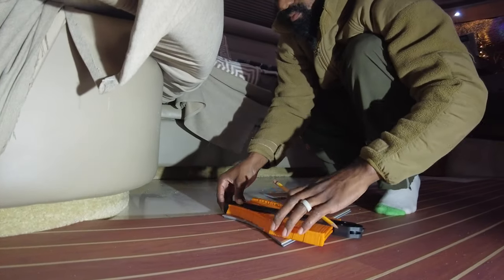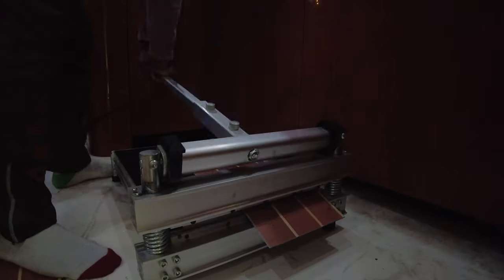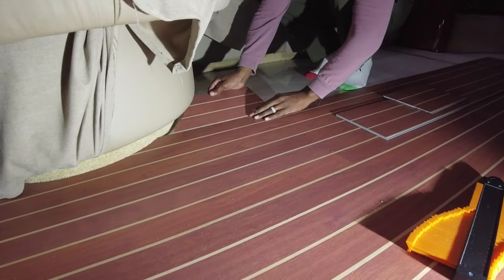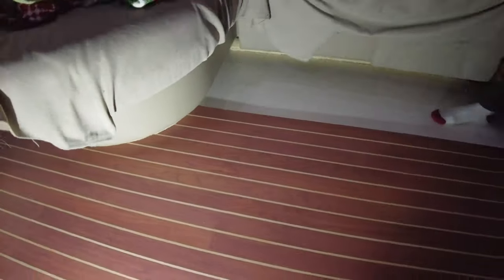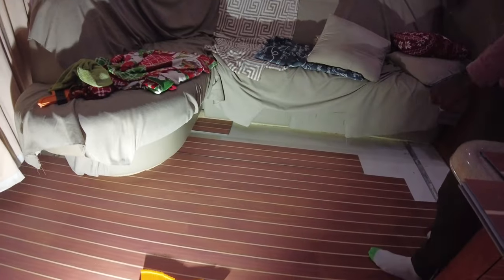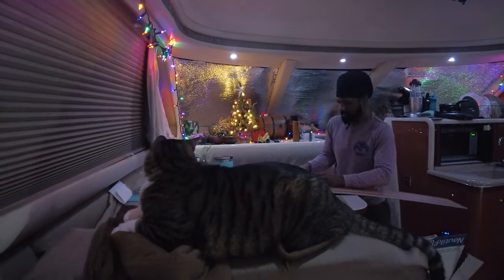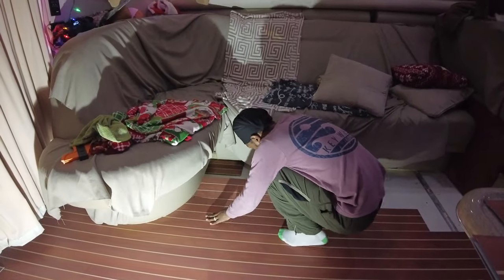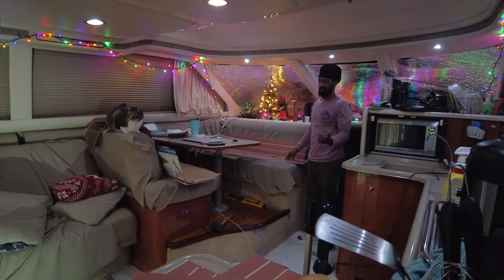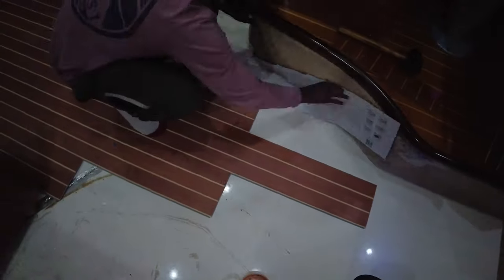Prepping and cutting is where most of the day and night went. For the pieces that went down quickly, that's just how it went. But for every four planks that went down, it seemed like there was that same number of complex cuts that required a jigsaw. Cutting straight cuts with the vinyl cutter tool, however, was a snap. For the longer pieces, we used parts of the box to get a template of the shape we needed to replicate on the planks.